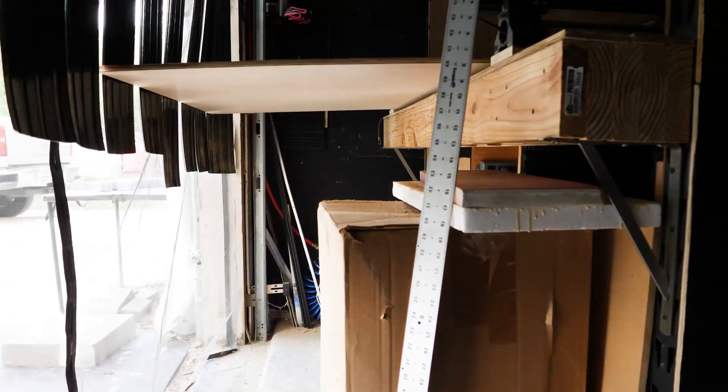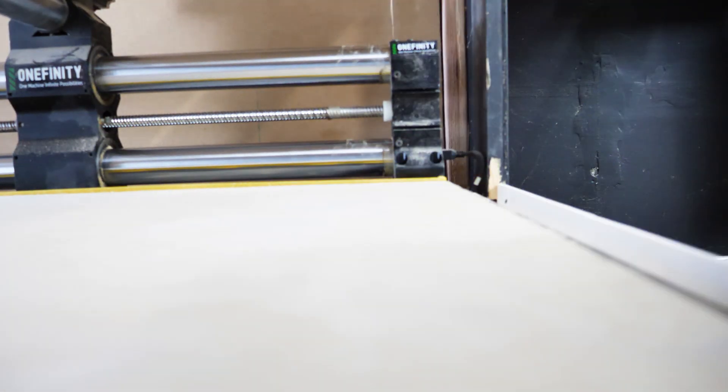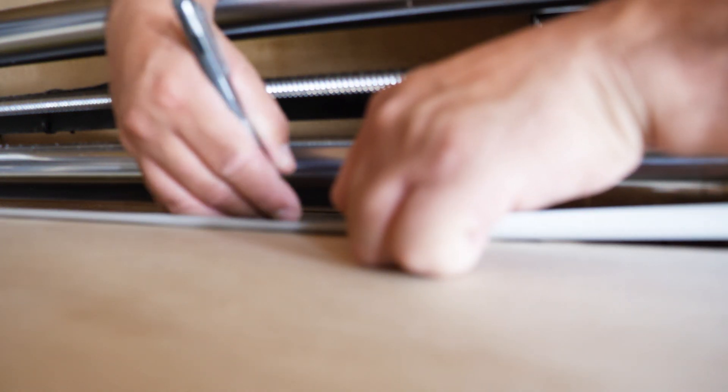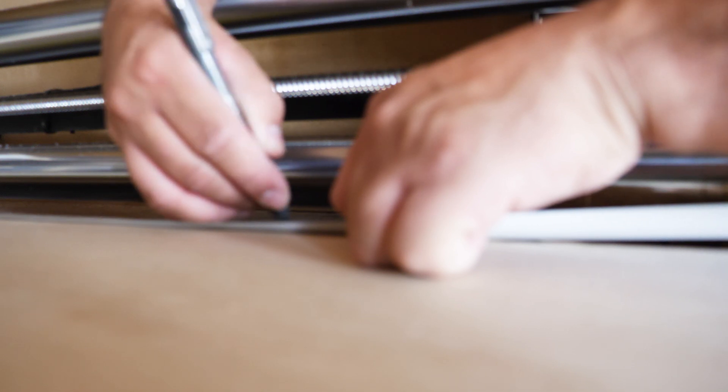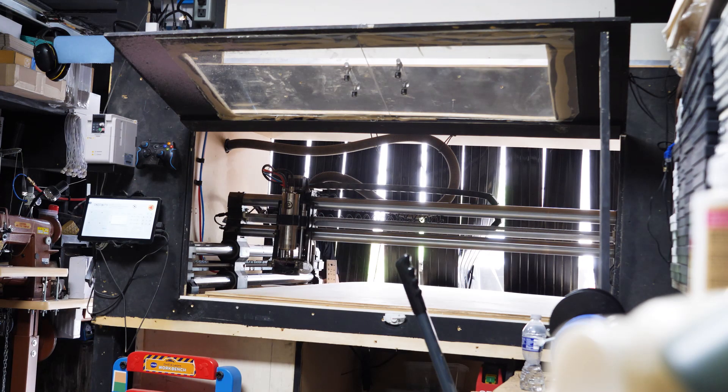All right, let's take a look at the other side. There's a jack stand I put up here just to level out the board, and in the front I use screws or brad nails — I brad nail the corners, which allows me to kind of line everything up. The next step is actually the most important: you see me using a measuring tape, I'm actually marking mine for each tiling section. I mark mine at 47 inches for each tiled section. You do the front 47 inches and the back 47 inches. I have a mark at the front where the first section starts, so this mark I'm making right here will line up when I do the next section.